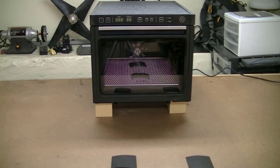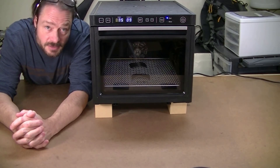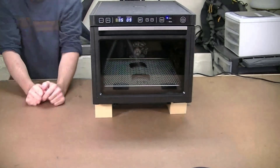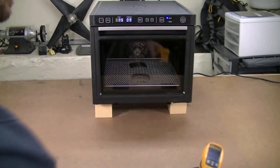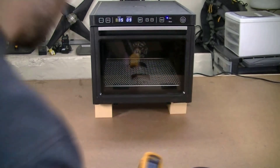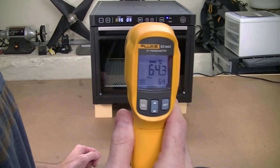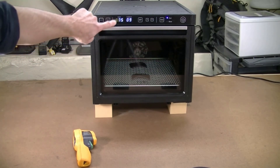Two test coupons as a control. Food dehydrator, take two. This thing's been going for close to a couple of hours now, it's probably about as warm as it's going to get — so it's a good time to test it. Ambient is close to 22. Inside — not encouraging. It's about 5 degrees better than the print dryer, but it's still more than 10 degrees lower than the set point of 75. How frustrating is that?